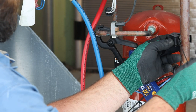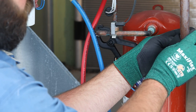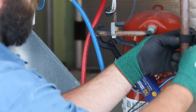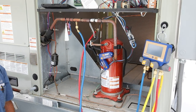The Y-Jack Wireless Temperature Strap will be powered on and attached to the suction side of the compressor. The strap is great for connections to larger diameter tubing and tight spaces where the clamp will not fit. Be sure to pull the strap tight once the probe is in place for the most accurate readings.